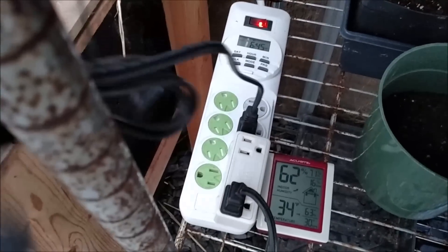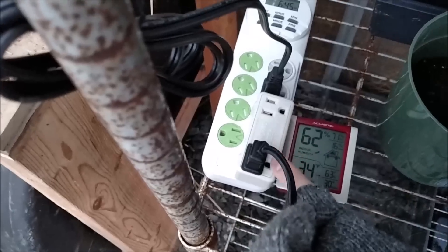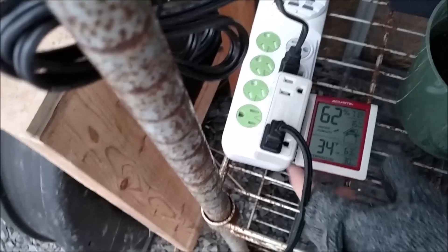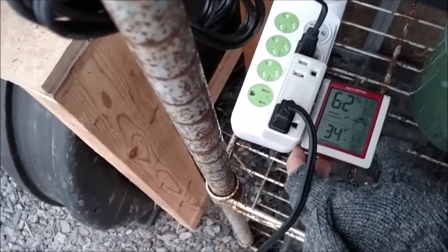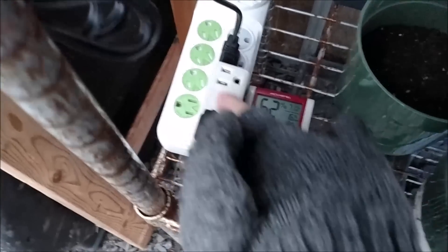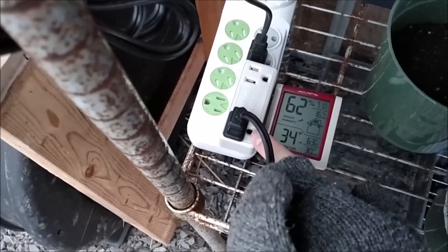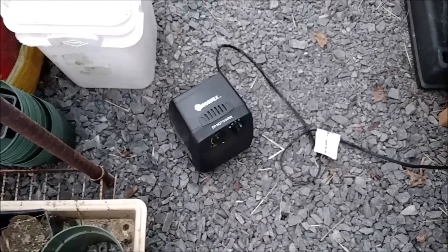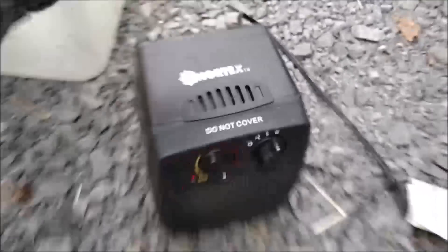Here's the heating mat plugged in. This little plug is actually a switch — this is what I have the space heater plugged into. And as you can see, this is just a little thermostat and humidity gauge that we bought. It just stands alone on a battery. It says it's 34 degrees, so this switch turns on at 35 degrees and turns off again when it reaches 45 degrees. That's perfect for this little space heater which is 1500 watts and about 12.5 amps. With the heater at 12.5 amps and the heating mat at less than an amp, it's enough for one circuit breaker and it's not a big deal.